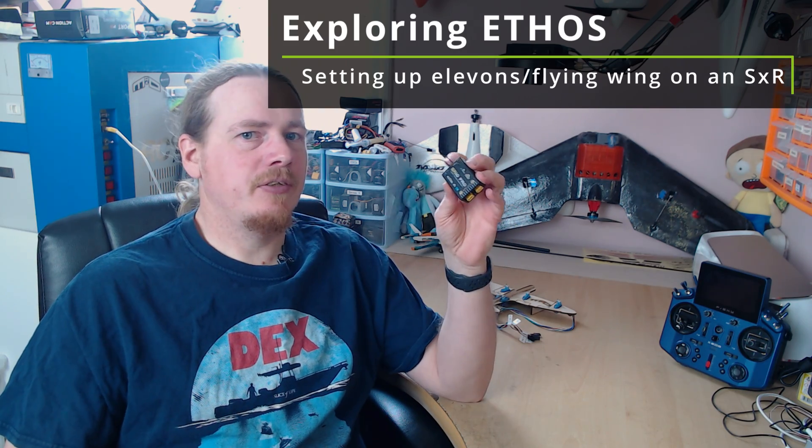This is quite an interesting one because I thought it was going to be really straightforward. I had a question come through about setting up one of these for a wing - something I've never done. I figured just set up an elevon mixer, set this to flying wing and you should be good to go. But that's not actually the case. I checked the instruction manual and there was nothing in there, then I looked on YouTube and found one video about setting up a flying wing - all that covered was the Windows application and switching to an elevon setup. So we're going to go through the full process, because you don't actually use an elevon mixer.